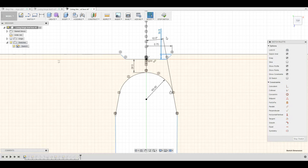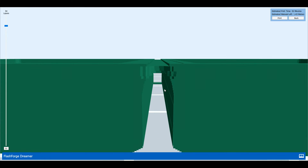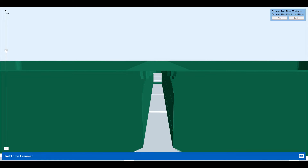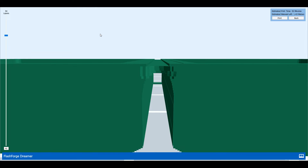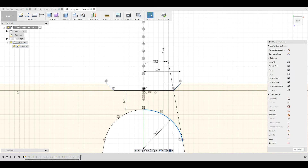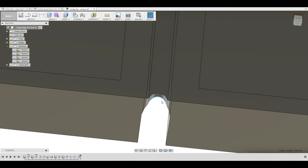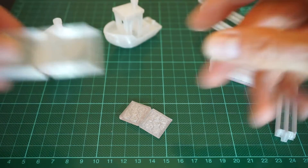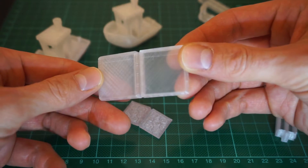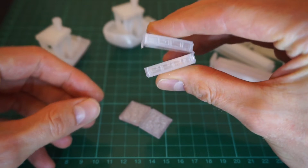The thickness at the center of the hinge is 0.4 mm. This means at the thinnest part two layers would be used when printing at 200 micron layer height. I used a smaller layer height of 140 microns, which resulted in three layers for the hinge. The radius at the bottom allows for a gradual increase of stress towards the center, while still making sure it bends at the right location. On the sides of the hinge an inward fillet is used to increase tear resistance. The hinge seemed to work fine — it was possible to bend it 180 degrees, and even after many consecutive bends there was no sign of fatigue or tearing.